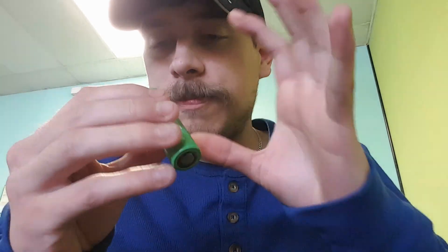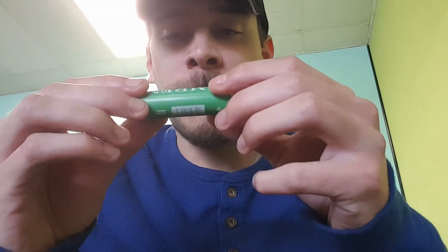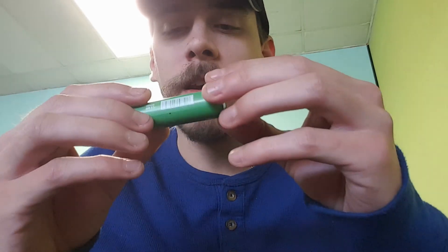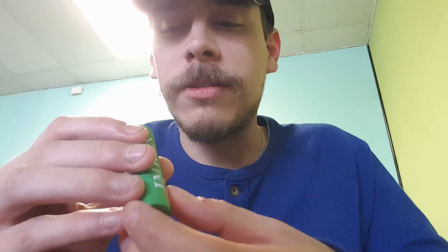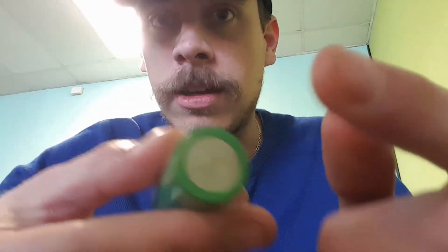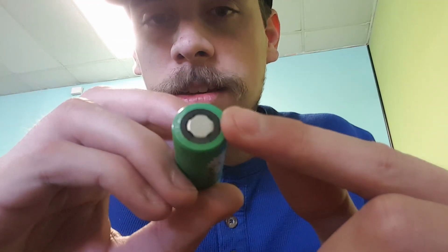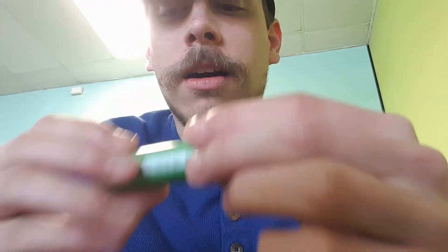It's always good to ensure that you have a wrapper on your battery. If you find an 18650 that doesn't have a wrapper, don't use it — put it inside a safe storage container like a battery box. Your main outside components are going to be the negative terminal (the exposed part of the battery), the positive terminal, the wrapper itself, and the positive insulator. Next we'll go over what to look for on your batteries for preventative maintenance, and then care and handling.